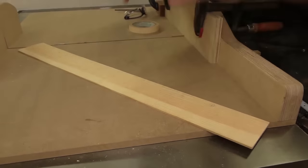Let me show you some that I cut a little earlier that I would do that with. Here's some right here, right from that same board. So there's my arrow. That's the sequence that they were re-sawn in. The bottom that he calls for is a quarter inch thick. So this was re-sawn. And this is a good example of the way I made that small eighth inch piece as well. So look, it's a full 32nd more than a quarter of an inch.